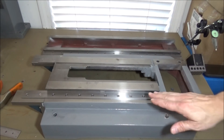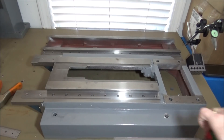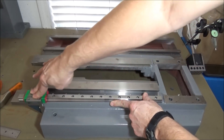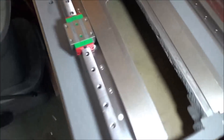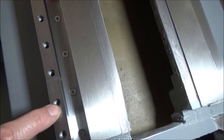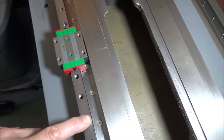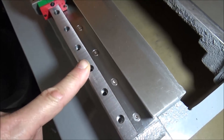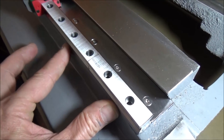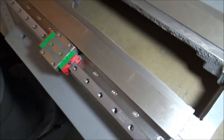Next I need to work on getting prepped and ready to install the rails. The rails are going to sit on there like so — there's plenty of clearance, a good sixteenth of an inch clearance here on the Y. We're basically going to do the same thing we did with the datums: clamp it in place, bore the holes, and then thread it. But before I install these, I want to make a clamp or a keeper to put pressure up against the rail so that it stays up against the datum.